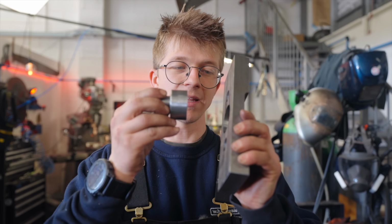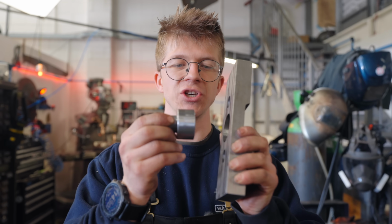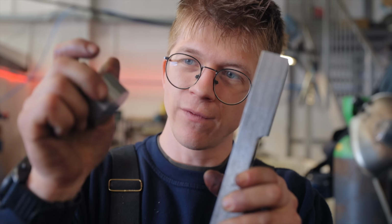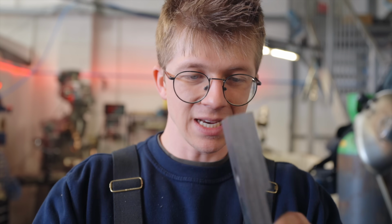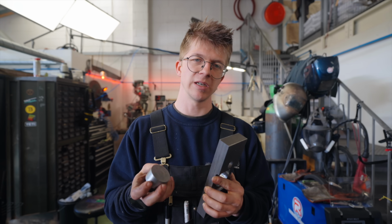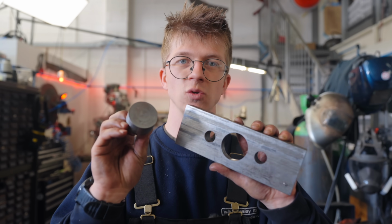One punch. Now these two things both need to hold an edge. As we are shearing our coins through, we're going to be putting a ton of force on these itty bitty corners, and those itty bitty corners, both sides, need to be sharp in order to shear and cut that material. So these both need to be hard.